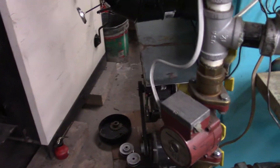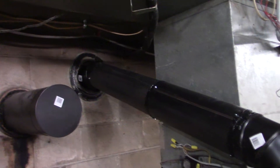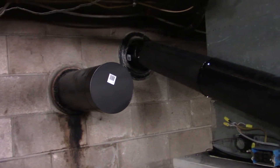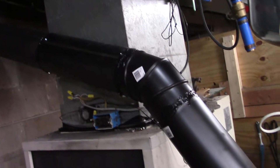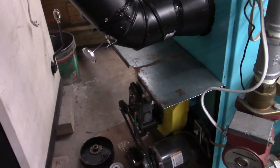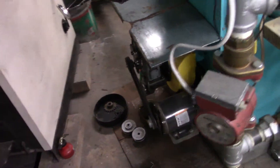Running the very low and slow settings, and we're going to try out this six inch chimney — that's taller than the masonry eight inch chimney. This chimney doesn't draft very well, so we're going to give this one a try. I mean, it is smaller than it should be, but we're running way, way less air than you would normally be running in one of these things, so hopefully it works out.